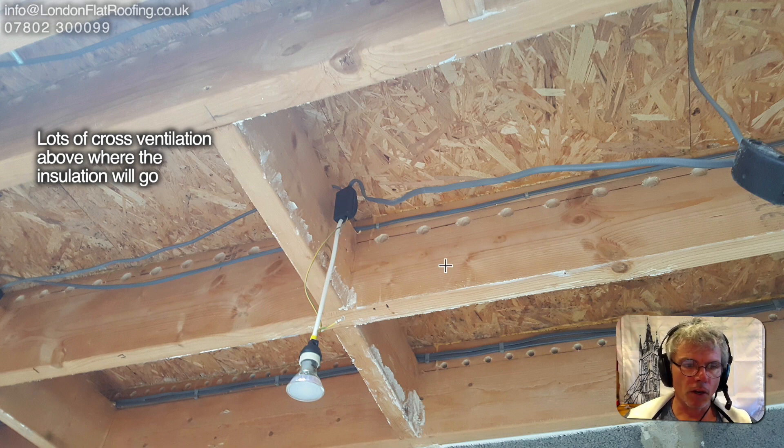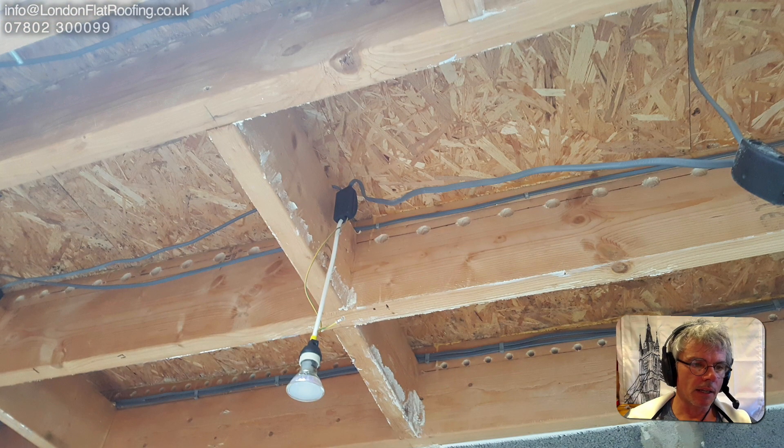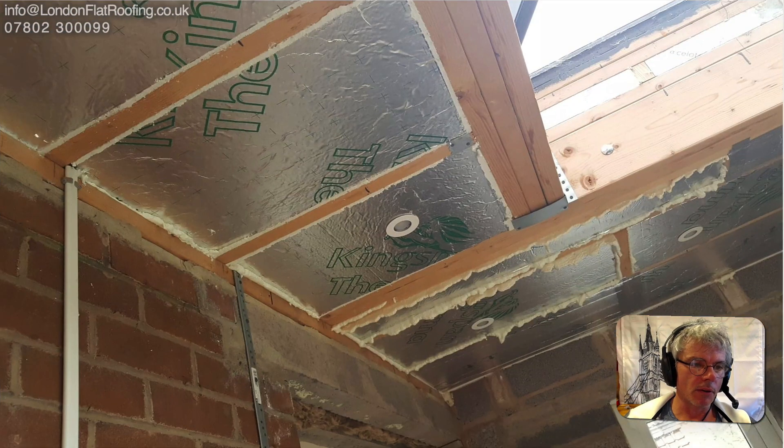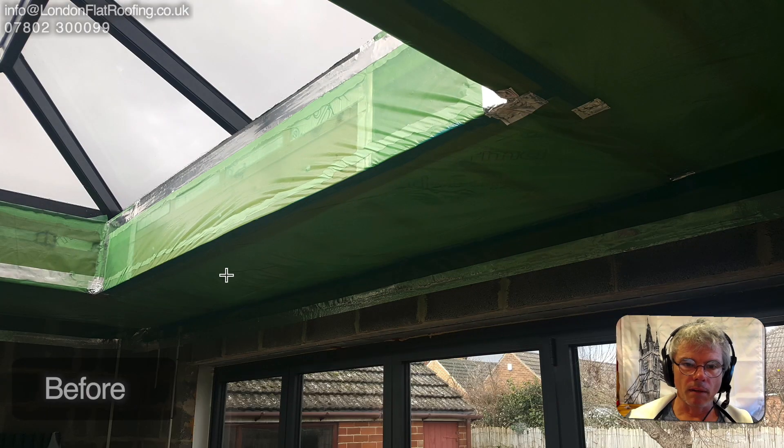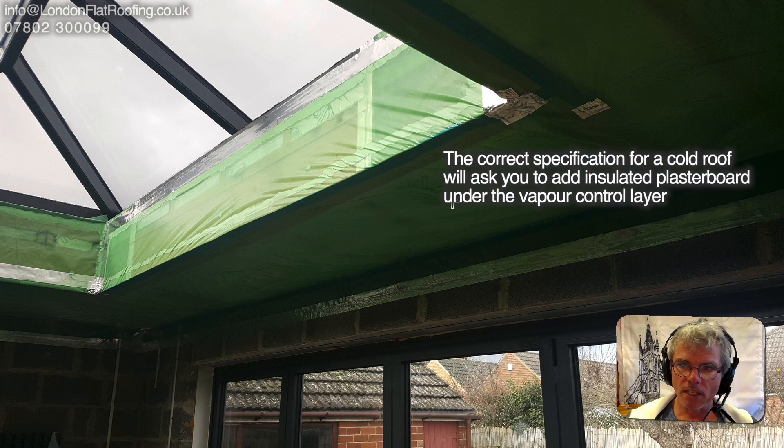This nogging here doesn't go to the top, so the air can easily blow that way, that way, and across — that is really making a brilliant difference. This is a before photograph of what it was like. He has now put all the insulation back in — in the next shot you'll see that — and he's foamed it all. He's not putting his lights back in, and we talked about putting a vapour barrier back in. This is what he's done: a brilliant job, lovely vapour barrier, the correct type used to the correct standard, taped everywhere to seal it all the way around.